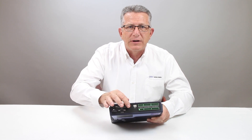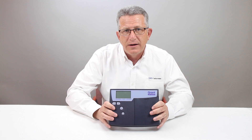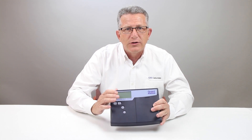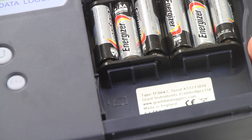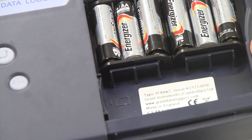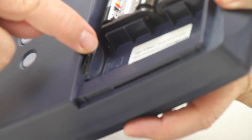The analog inputs can be configured as 8 differential or up to 16 single ended. Data is logged to an internal SD card with up to 2 million stored samples. Data can be unloaded via the Ethernet or Wi-Fi connection to a PC, or unloaded to an externally accessible SD card for data portability.